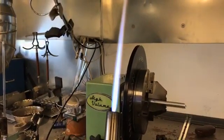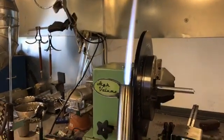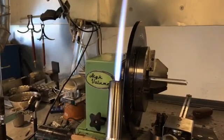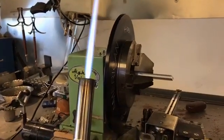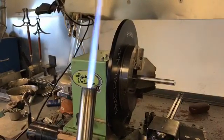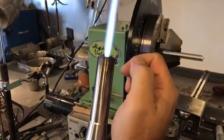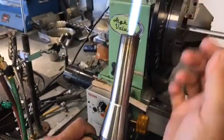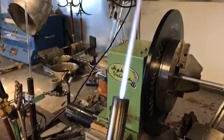Now if this was lower, what would that flame look like — would there be more orange? It's hard to demonstrate without putting a bad machine on there, but basically the flame is going to flutter and dance. It's not going to connect to the torch — you'll have that issue where it's making a loud noise and it won't seem to connect to the torch.